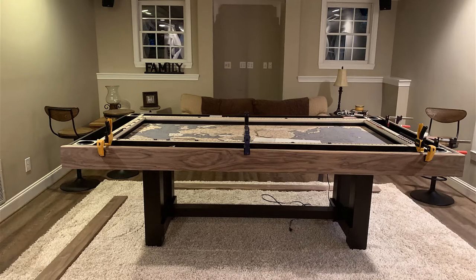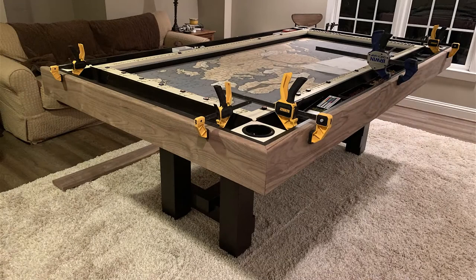Through the previous miter cutting that I've done, I found that the secret to getting a nice tight 45-degree cut is to really sneak up on it. Don't think you're going to be done with one cut. It's best to sneak up on it, purposely not cutting it precisely. Then once you temporarily place it up there, you can start removing wood at like a 32nd of an inch. I found that that's the best process. Sometimes it may take 3 cuts to get it to fit perfectly. But in the end, once you do that on all the corners, you'll be rewarded with a very nice tight corner.